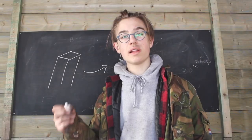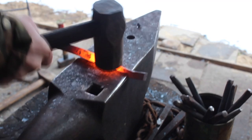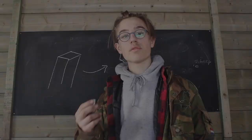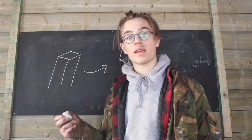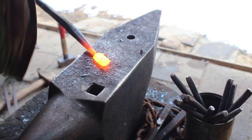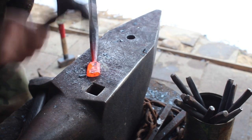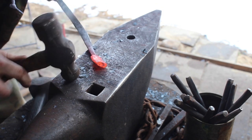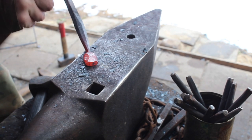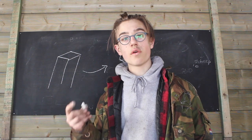The next step is to make the little taper flat. After we forge it flat, we can start on flattening the little area which will be our owl head. We'll use a ball peen to stretch it out even more, then we can start forging in the ears.